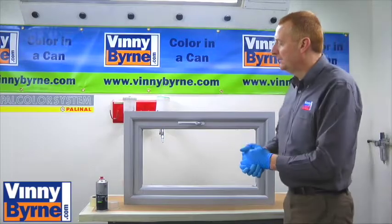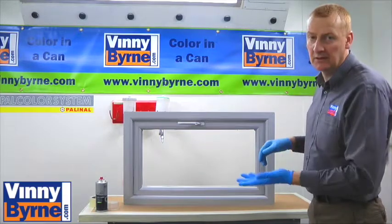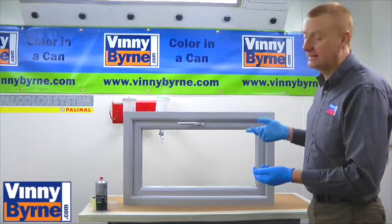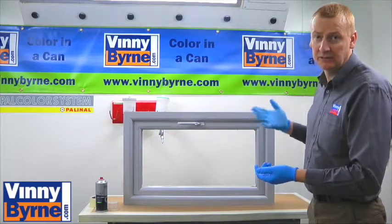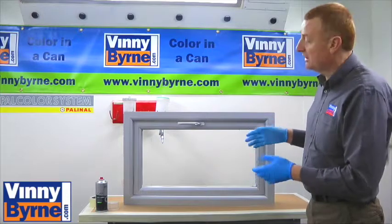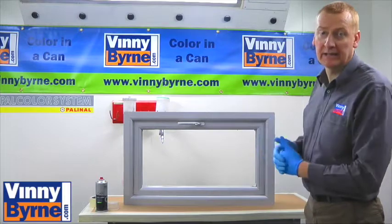Okay, we've now covered the window frame. We've given it 3 light coats. We started off with a light coat, left it 10 minutes, then gave it a second coat, and left another 10 minutes, and then a third coat. We've left it 24 hours to dry, so now we can take off the masking, and the window frame is now ready to go off and get glass put into it.